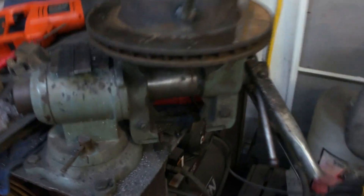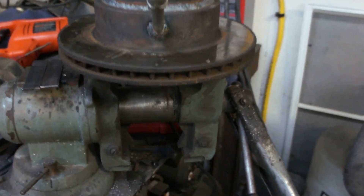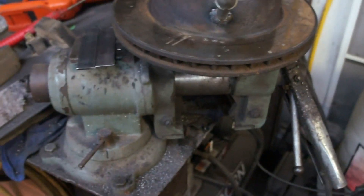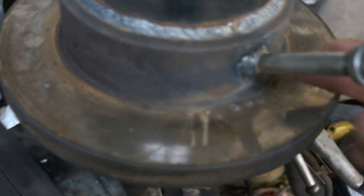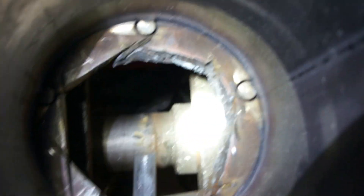We started building one here in the shop. Here's the main burn chamber — it's just a rotor off a 1995 F-150 four-wheel-drive pickup. It's a cooled setup; you can see the light shining through — that's how the air gets in all the way around. I made an oil feed for the drip system using simple galvanized quarter-inch pipe fittings and a little chunk of pipe. I drilled a hole, slid it in, and welded it into this six-inch steel piece I got from the steel store.